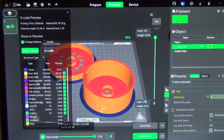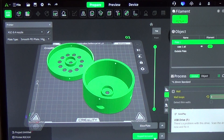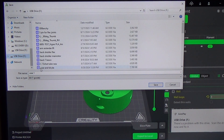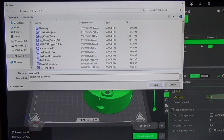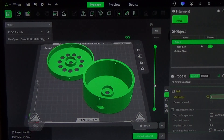That's going to take two hours 58 minutes — about three hours. It's going to take 95.32 grams of material to print. That's quite a bit of material, but it's a good-size case and definitely worth it. Let's go ahead and export to local, stick our SD card back in, and save it as 'case and lid PETG' so I know what material it's sliced for.